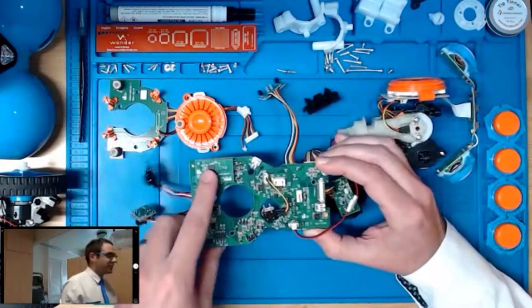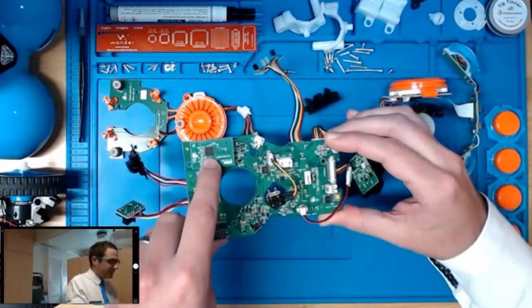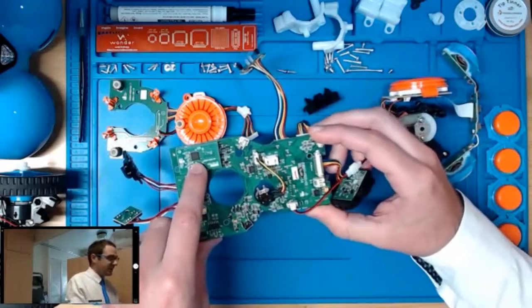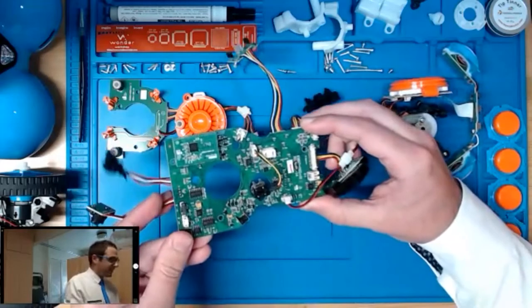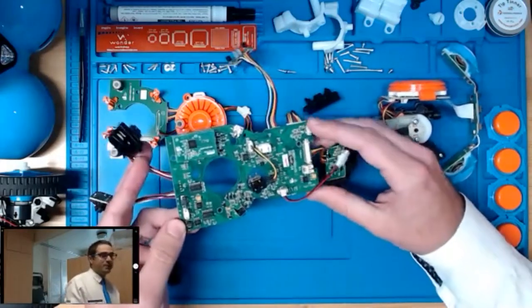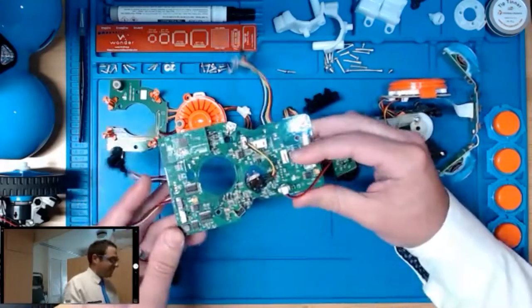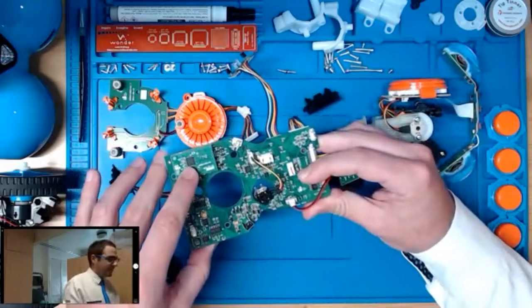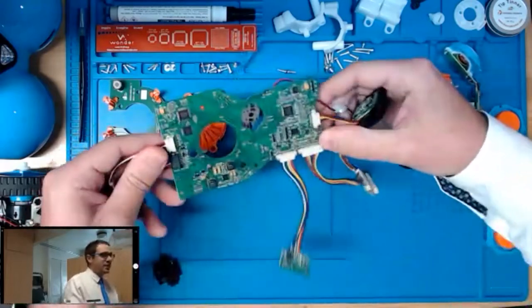The first one, which you see up here on this top small daughter board, is the Bluetooth microcontroller. This establishes the communication between your Chromebook or your iPad and the electronics inside of Dash. Francis will talk about how we are able to use that connection to send data back and forth and do important things like firmware update. But for now, in terms of electronics, this microcontroller also talks to the other two microcontrollers on this board, which are on the bottom surface.